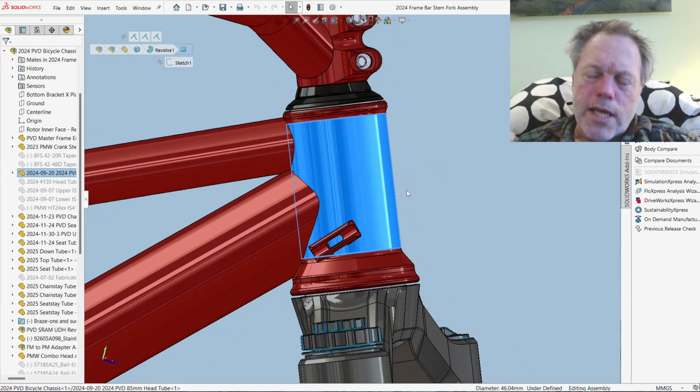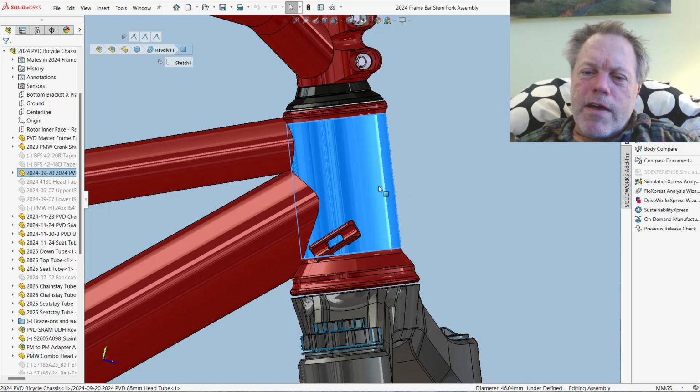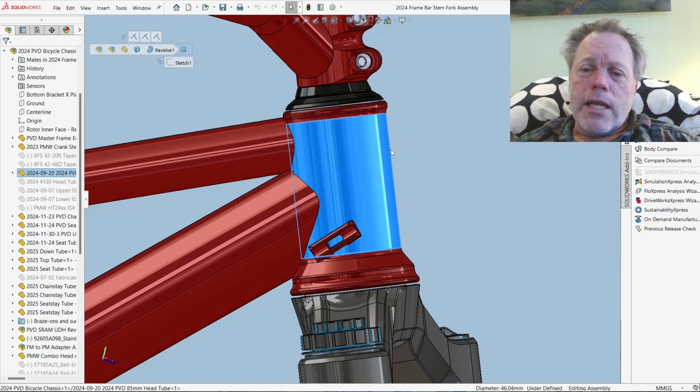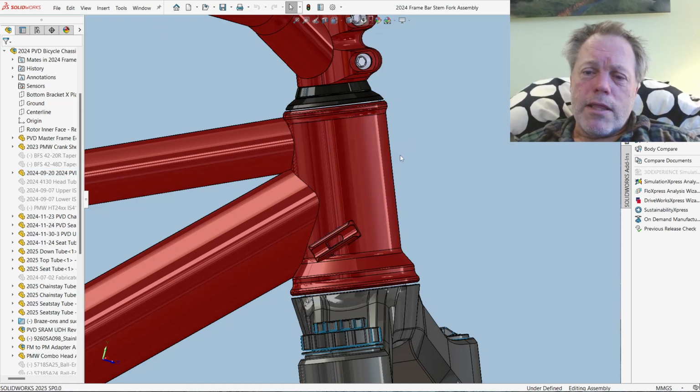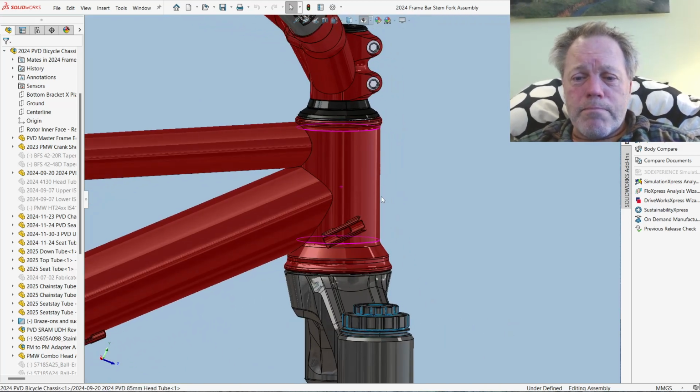with a unitized type. I was doing the segmented style where I'd press them together, but that forced a 2-inch OD here. And by going to a single machined part, not only is it cheaper monetarily, but it shrinks this diameter. I think it was 1/8 of an inch or so, and that may seem like a small amount, but it adds up.